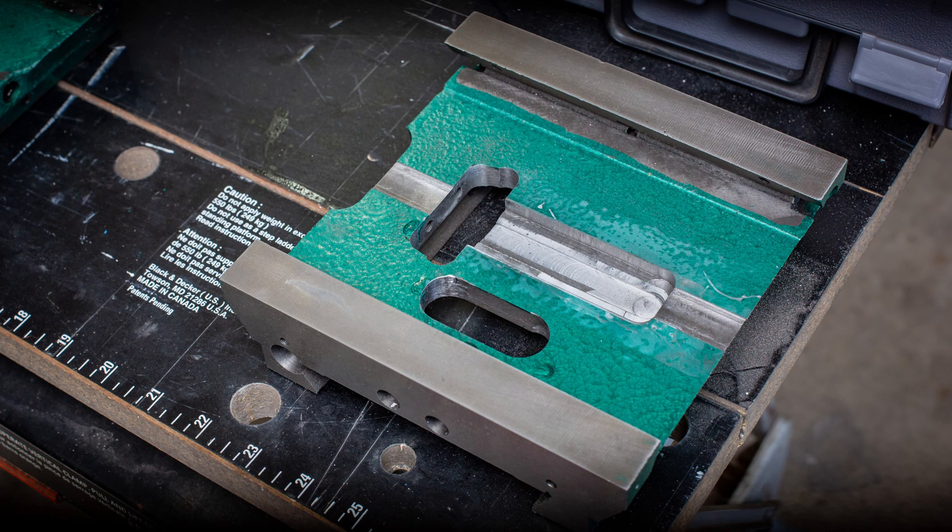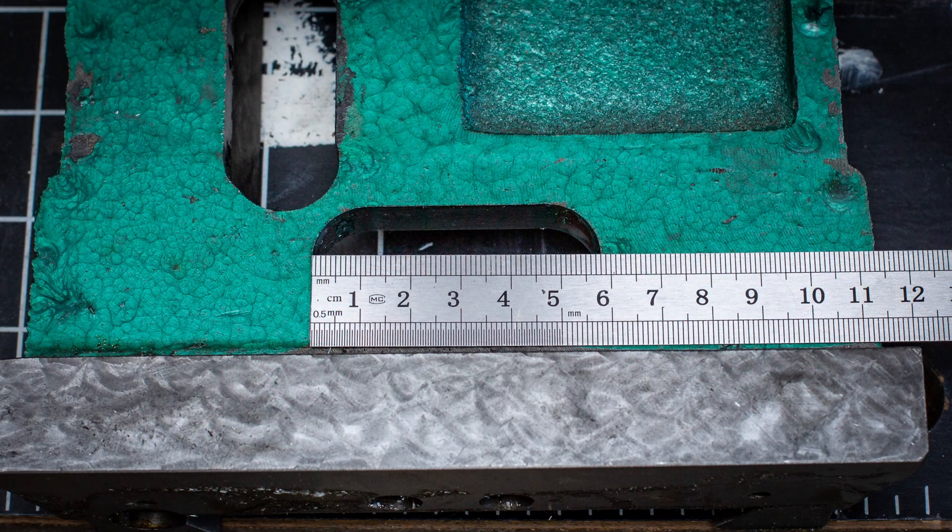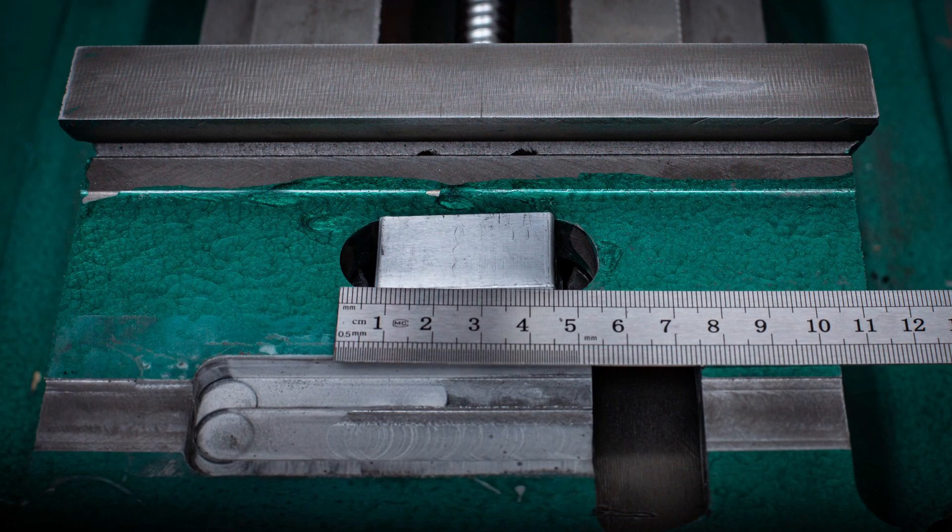This is the saddle that the end mill chewed through. I decided to continue using it and did a cheesy repair by filling in the damaged area with JB Weld, a steel reinforced epoxy. This should be more than sufficient to get the mill up and running so I can mill the clearance slots in the other two saddles. Now back to the ball screw installation. The aluminum clamping block fits into the oval slot, but on this saddle the oval slot is not wide enough, which leaves a gap between the clamping block and the face of the saddle. These fitment problems are caused by differences in the castings — the slot on my original saddle is about 58 millimeters wide and on the new saddle it's about 4 millimeters narrower. It's no wonder things need some modifications to make them fit.